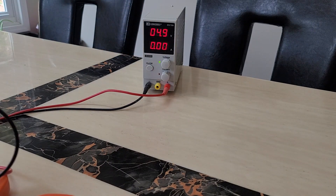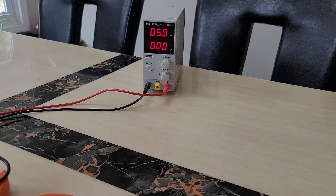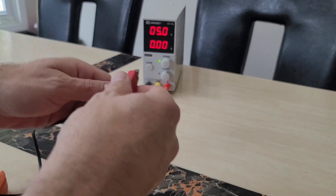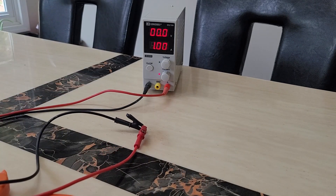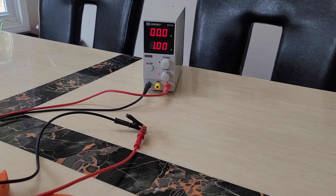I'm setting up at five volts on these Chinese power supplies, which you can set to constant current. I've connected the two probes and pre-tested this - we are currently set up to do one amp. The power supply says one amp. Let's see what our testing equipment says.